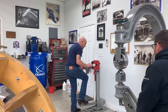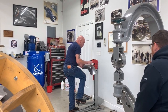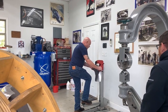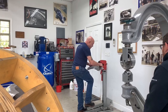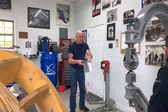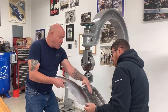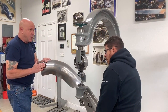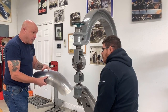Loose edge on the base down in here can be taken care of and we can get more accurate. If we take care of this one before we tighten up this one, you're going to come across an issue. So just tighten up that edge, just a little bit of a shrink, just using the shrinker to do that, so the motion on there is very, very small bite marks. But you can see now we've got rid of our waffle, not shrinking it too much so that we change our flatness. We want this flatness. If I shrink too much on this, this panel's going to curve. I want to take care of this first.